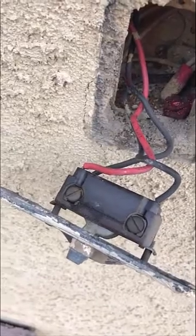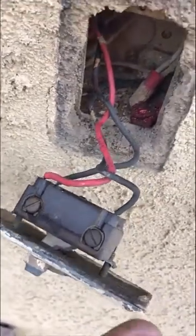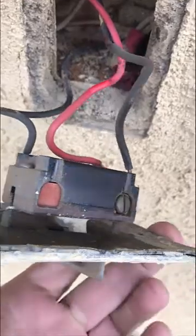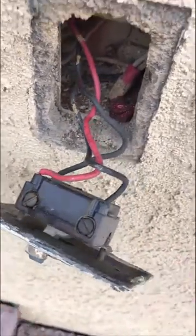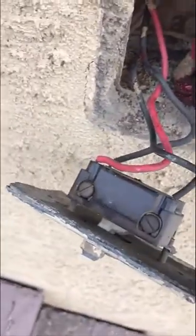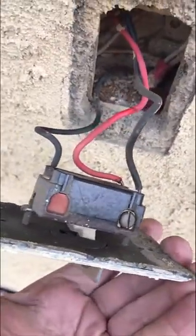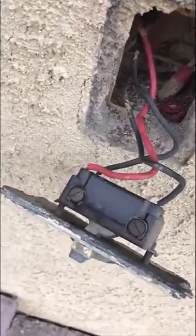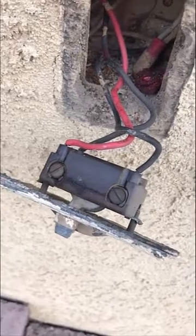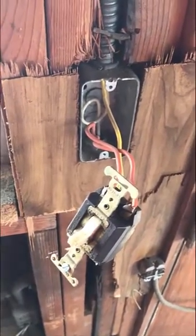In this case there's a red wire on the shinier screw. I usually refer to them as brass and bronze, but turning it around I see another screw that matches that same color — so the odd color here is the black one. The two matching screws are your traveler terminals, and the odd-colored screw is either your hot wire coming in or your load wire going out. That rule is consistent no matter what three-way switch you look at.